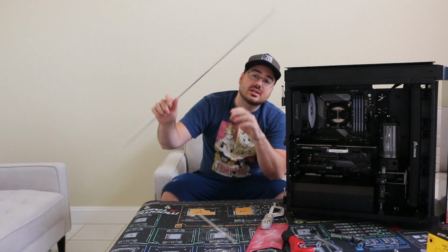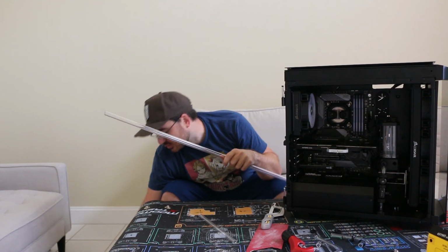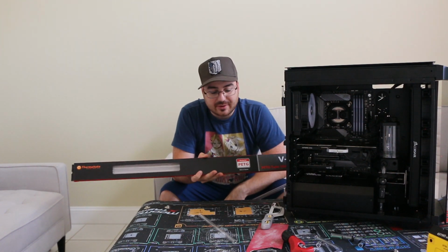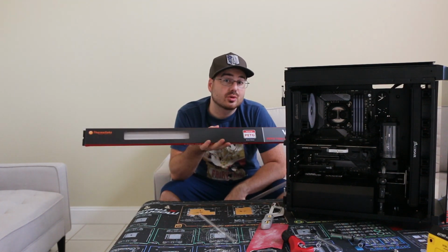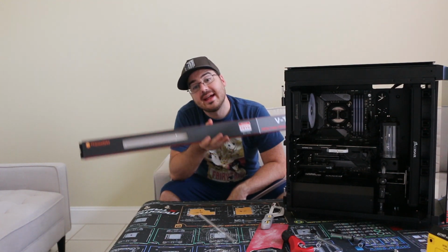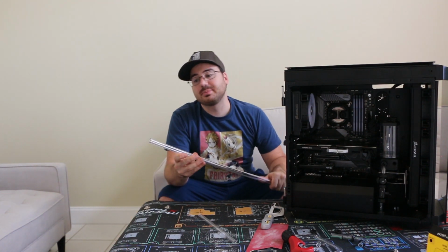Go on Amazon and you can purchase PETG tubing for, I bought for $22. I bought the Thermaltake. It's about 4,000 millimeters of PETG tubing from Thermaltake. So please, if you're a beginner, you're going to want to work with the PETG instead of the acrylic, and I'll show you why in a couple seconds. So let's start out with cutting with the PETG.